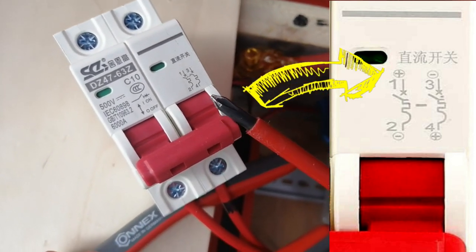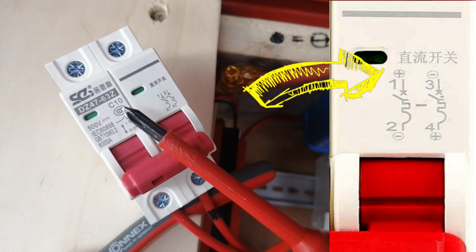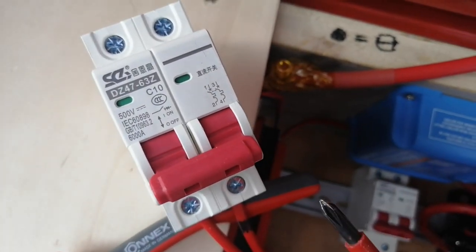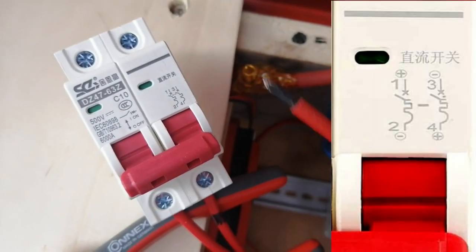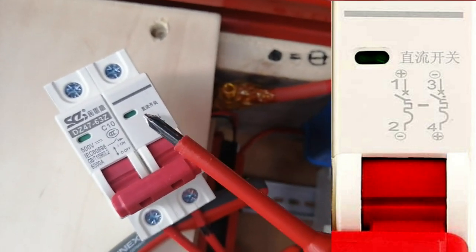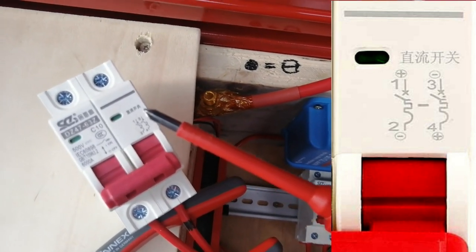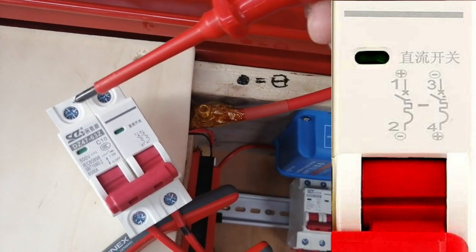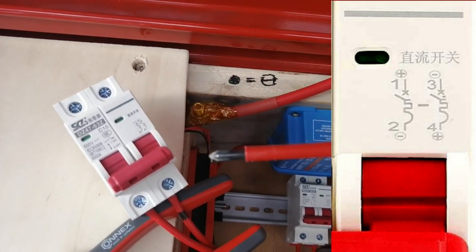You can see that usually there is a plus and minus symbol somewhere on the diagram. For example, in this picture I don't have the plus and minus symbol, so there are two options: either this one is not polarity sensitive, or they just have the wrong diagram. I looked up a lot of images online of this breaker, and they all have the diagram with the plus and minus symbol. So I used the online diagram to wire them up. When you look at those diagrams, by the law of proximity in user interface design, you might think that the plus and minus close together represent the incoming line - plus here and minus here. But then on the other side you'd have minus and plus, which would mean the wires are crossed inside - which is of course not the case.